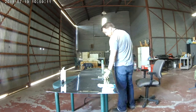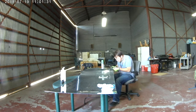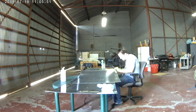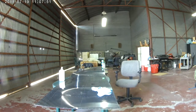In this video we're going to be prepping everything. All the holes have been deburred, which we saw a couple of videos ago — had those deburred while the skins were mounted up to the ribs still. So everything is deburred hole-wise. Now we're just kind of doing the edges, which you saw me doing at the end of the last video, and now I'm just finishing those up, and then we will be dimpling.